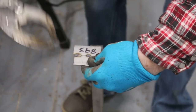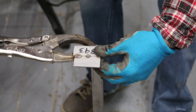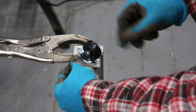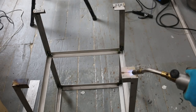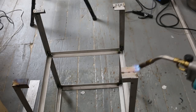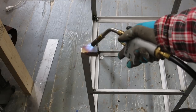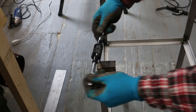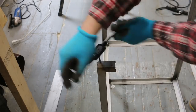I fabricated some little feet from 1/8 by 1 inch angle steel so I could attach the casters. I'm annealing the steel before drilling — it makes a huge difference once it's been annealed. The steel I'm using to build this whole station is 304 stainless, one of the most common stainless steels out there. I could have bolted these on but I decided to tap some holes to accept bolts — I just like it because it's a little bit cleaner and tidier.